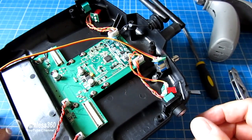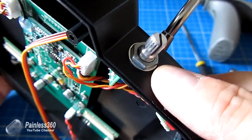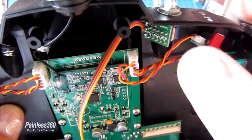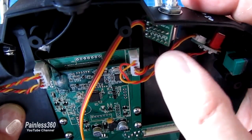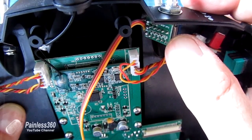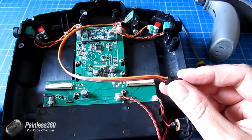After a little bit of drilling and filing, we have the switch fitted. Here it is in position, held in place by a bolt on top of the washer. I put it at a slightly oblique angle — it just fits in between the two veins that I had to whittle away. The wires go: ground at the top, signal in the middle, and VCC at the bottom. I'm using a servo cable to wire it up, with the three wires already popped on before installing it for simplicity.